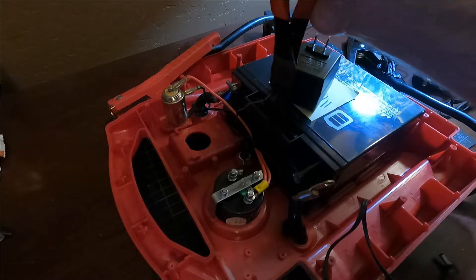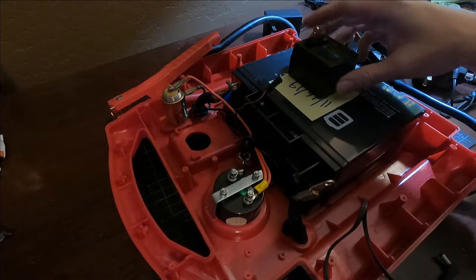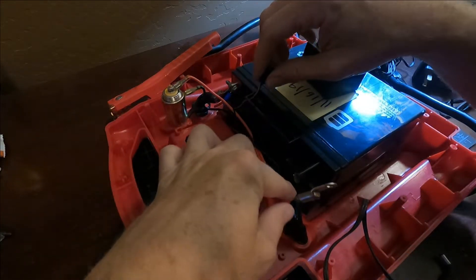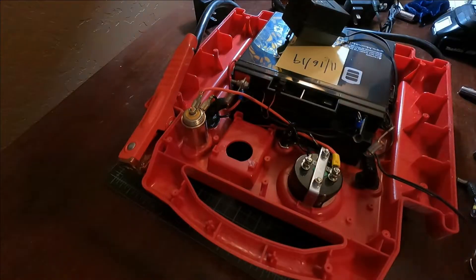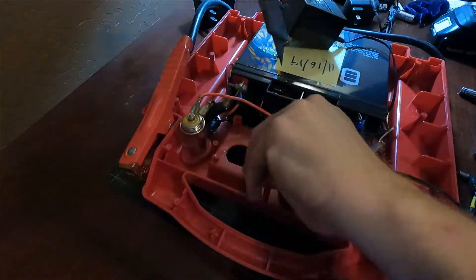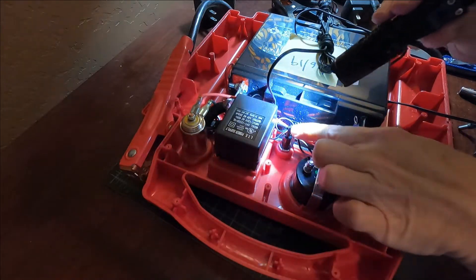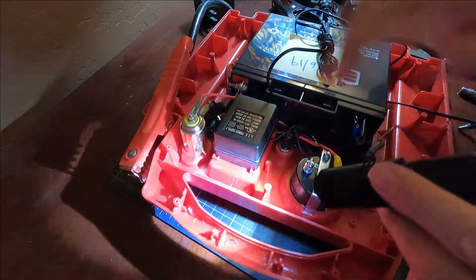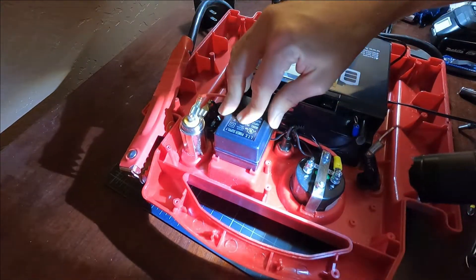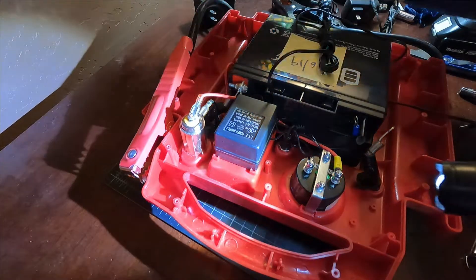Time to get rid of the original power supply. Now with those tabs out of the way, the back of the transformer fits right up against the bottom in there and isn't blocked by the front. It's still going to be held down by the bracket, and its vertical position of the terminals is still assured because it's at the same height as the original terminals.